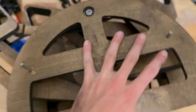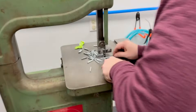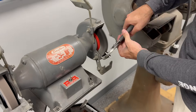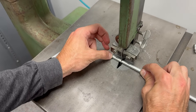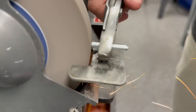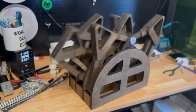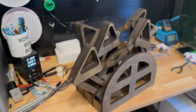The axles in this project were not easy to make. The crankshaft uses an 8mm axle and all other axles are 5mm. We ended up cutting all the axles ourselves on the bandsaw — each leg has five axles and there are 12 legs, so that's 60 axles to cut. Now that we have all the axles, we're ready to assemble the first half. Each half consists of three sets of legs, all offset on the crankshaft by 120 degrees, ensuring maximum ground contact so the table never tips.